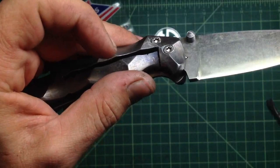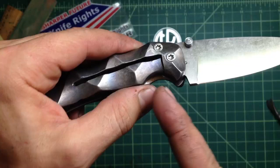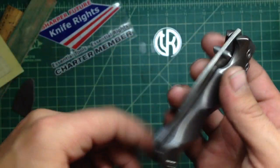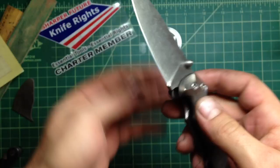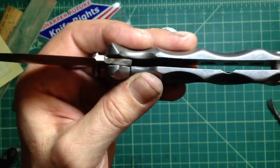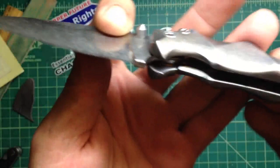Everything is good, but it's just not perfect — that's what I was talking about yesterday with tolerances. I didn't put enough thought into it upfront; I figured whatever I do I'll make it work. Maybe when I redo the blade and put a different blade in, I'll do it a little differently — maybe drum out or sand down a little bit to move that locking surface back. For now, let's call it a friction folder with a detent. I think I'll be able to fix it somehow.